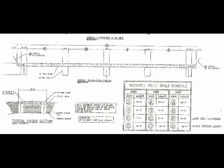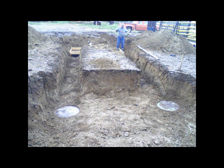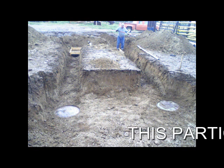If you are attempting to pour the foundation yourself, please follow the blueprints included in your information packet. Using a backhoe, dig down where each piling will be placed. Make sure your corners are squared and place your piling in each hole. 55-gallon drums are perfect for piling forms.